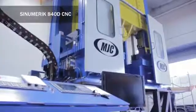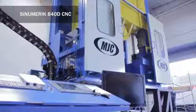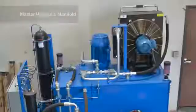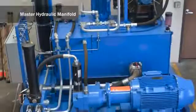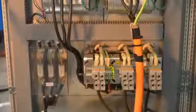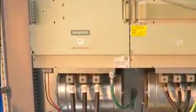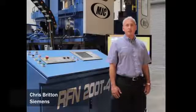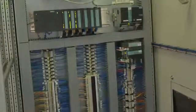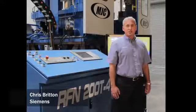This particular machine utilizes a combination of the power line and solution line drives. They were able to tap into a 455 horsepower spindle motor on a chassis format. The advantage of this particular drive family is that the previous solution they were using required a number of drives — one for the regeneration side, one for the generation side. This particular unit, in one drive, gives you the ability to do full line regeneration back to the grid and do the power matching, resulting in simplification of the existing solution and cost reduction.